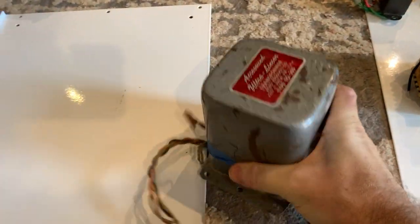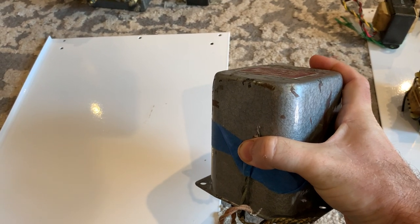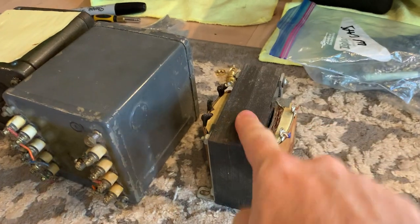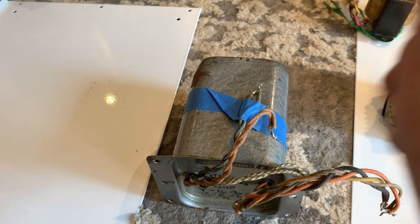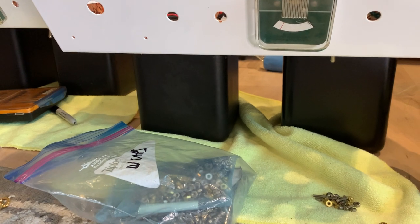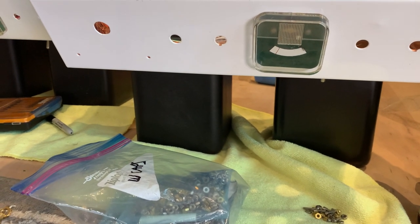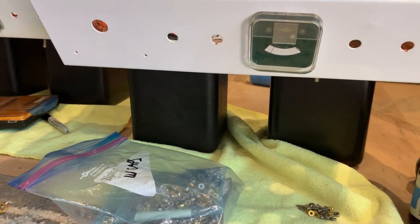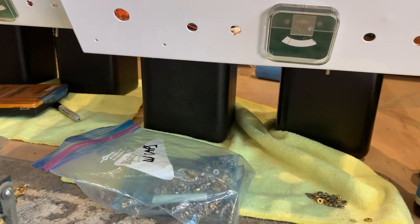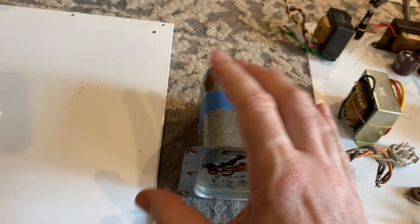So what is a potted transformer? For example, let's have a look at this — this is a potted transformer. You see, it is encased in a metal cover. If there's a transformer inside, they put oil or tar — what they did with the Heathkit was fill it with crushed granite, and then they put tar onto it. They do that because the crushed granite dampens the resonances of the transformer. So the art of making a potted transformer is really about resonance control — how to make sure that it doesn't vibrate. Because when alternating current flows through a transformer, it starts to vibrate and resonate.